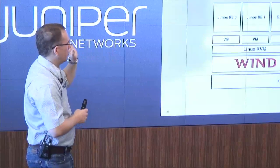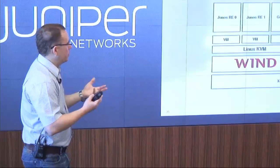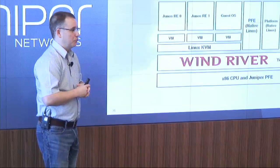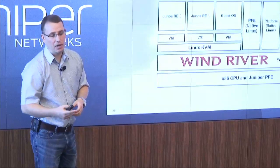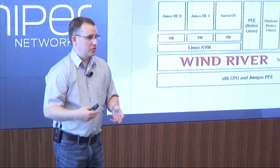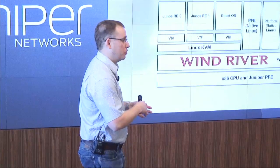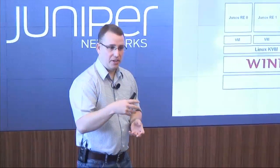To round this out — I already talked about the CLI and structured data, but some more detail: we do a lot of our API through Apache Thrift. Regardless of what programming language you like — Perl, C, Python, whatever — we give you IDLs for the structured data, and you can use your favorite programming language to program this switch. You can program the control plane, the data plane, or any platform things such as fan speed. We give you every bit, byte, and register that you really want on a switch like this.